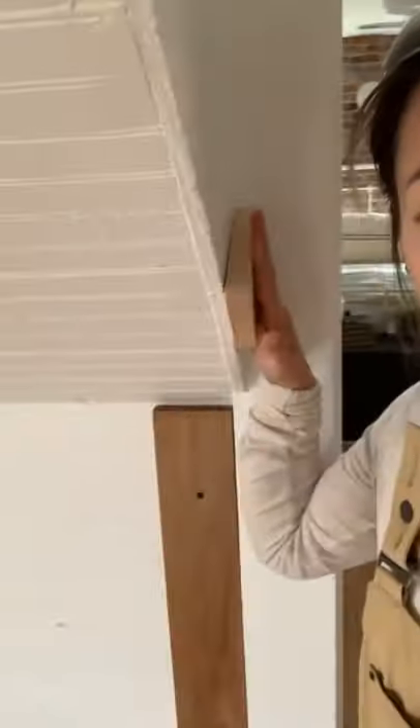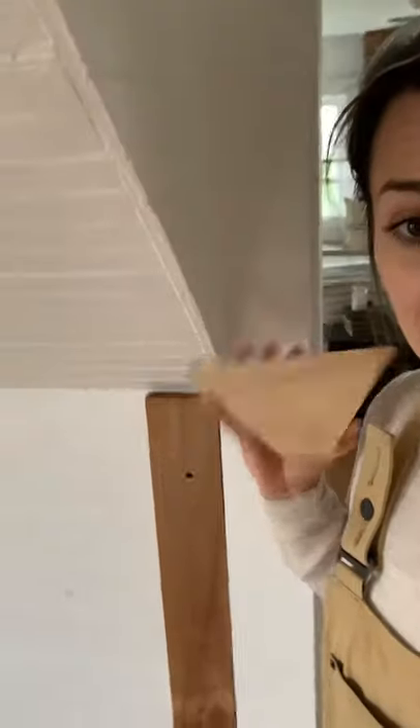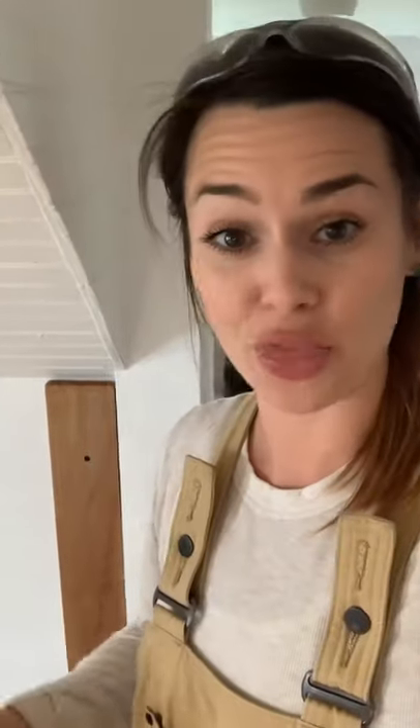Because I'm running the wall right alongside the door molding, I did have to fill the gap. I used a 1x4 to fill the gap and then I'll put a 2x4 stud over the top of that so everything will be flush. I also had to find the angle of the roof line here, because it's different on each side of the room and I'll have to cut each stud in this area to match it. To find the angle, I set a piece of wood along the roof line, marked it, then set it on my saw — it came out to about 36 degrees.